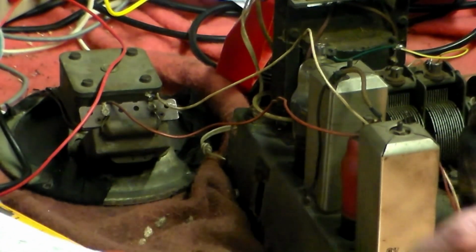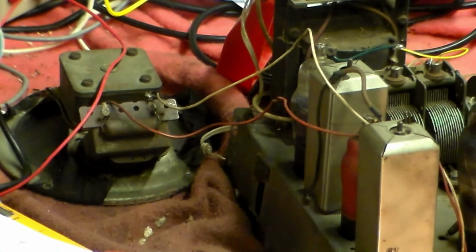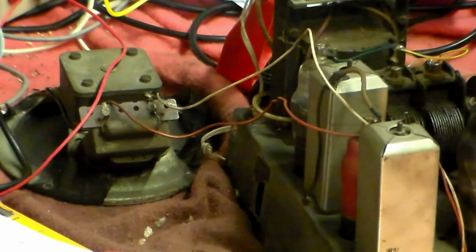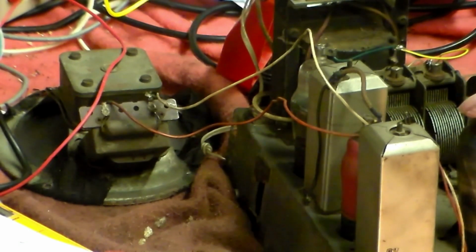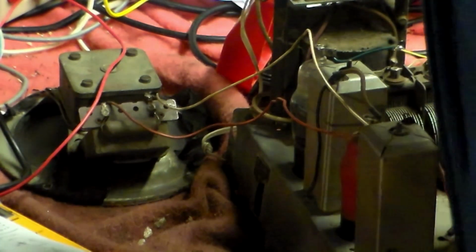And this circuit here, which is the AGC, goes from R2 right the way back to our line, which of course is not tied to deck on these. So it's a matter now of finding out why it's not doing what it should. Well, it is doing, but not powerfully enough. It could be the valves. I admit it could be the valves, but I personally don't think so in this case. By the way, you don't align until you sort out all the faults.